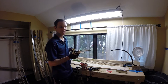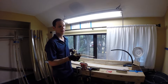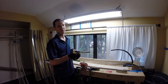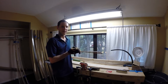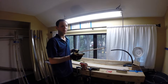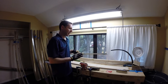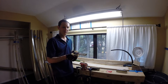The final dimensions of the butt sections in this rod are going to be around 320 thousandths, so each one of these strips has to be half of that — 160 thousandths. That's going to be the widest point of this rod; it'll eventually be tapered down narrower. But for this stage we want to be above that 160 thousandth final dimension, so I'll actually plane them down to somewhere around 190 to 200 thousandths.